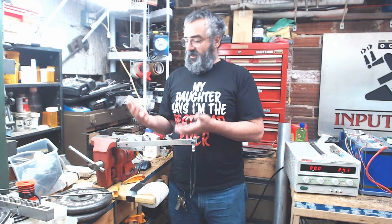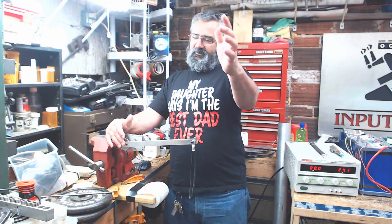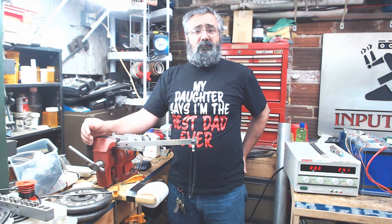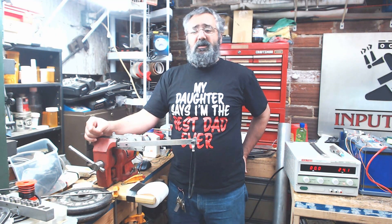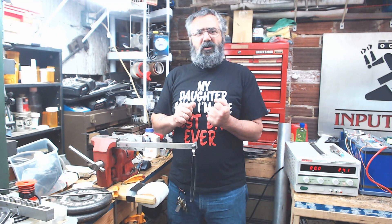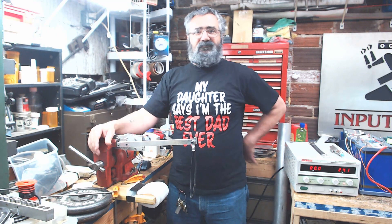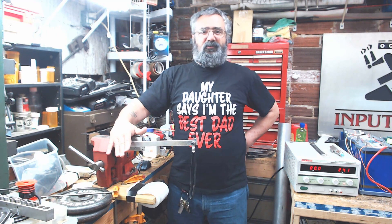The servo is now performing as it's supposed to perform. To the manufacturer — I'm going to be sending you this video — you have a gear problem. Your gears are not hardened, which is causing them to fail, and in a critical application like Bjorn Harms's builds, he's had these things strip out on him where he accidentally got a servo setting wrong, traveled further than it was supposed to, and the gears just let loose. It shouldn't do that — it should simply stall, like it did here.